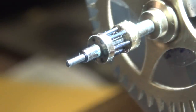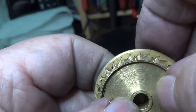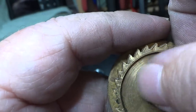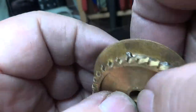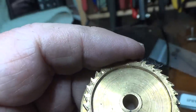That should do it. And did I get it in there? We have to disassemble these wheels to get the center piece out. And from past experience, I know that this is a hexagonal piece of brass that goes through there. And then it was peened over, and it looks round, but it is actually hexagonal. And I have to take this apart, get that piece out, get some new hexagonal brass, drill a new hole through it to resize this hole so that when I put it back on